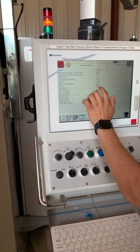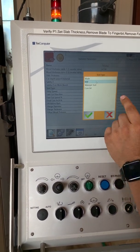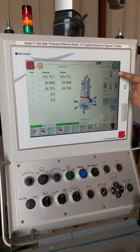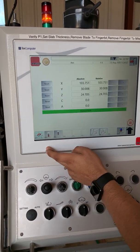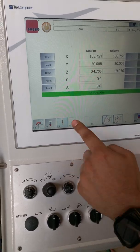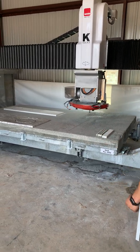Come up to tool type and click on it — you can see it shows blade there. Click on that and change it to the mill. The finger bit is known as the mill. Click that and escape. Now we have the finger bit set. We're going to go ahead and measure it — click F1 and then F3. It's got a little air cylinder icon on there. Click that and your air cylinder will pop up. The head will tilt down and it's going to go and measure.